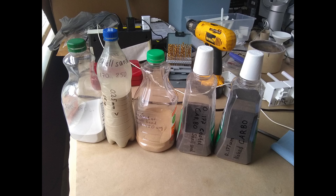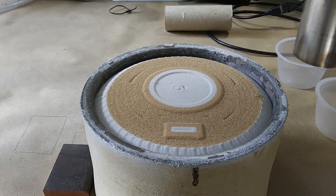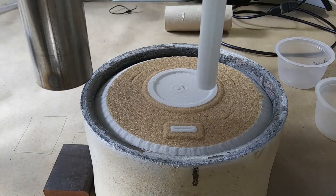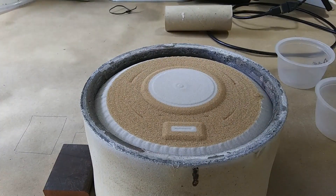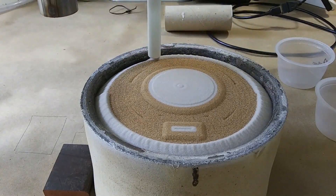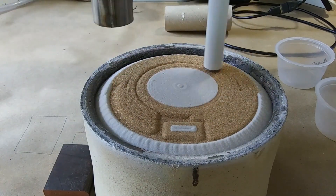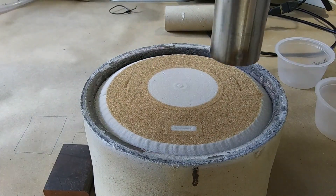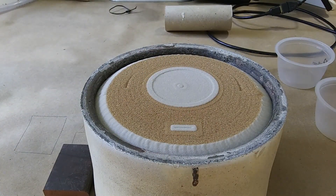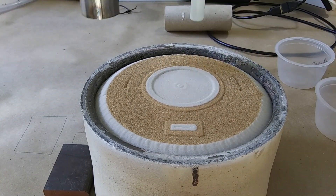The cheap and most common ones are based on quartz, and pretty much all of them are coated with phenol formaldehyde resin. They use phenol formaldehyde because for shell molding the resin must be thermoset. But in our case it doesn't matter — it can be thermoplastic. So in theory we could use PLA if someone made shell sand for this specific application, giving a much larger choice of binder.